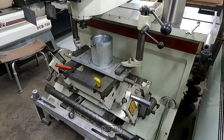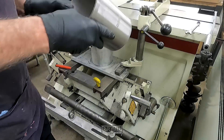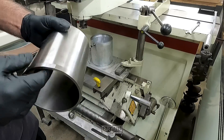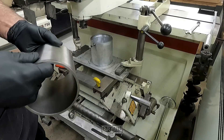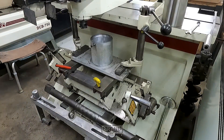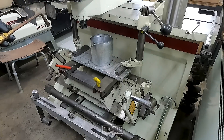It can be changed at the racetrack without having to do all that stuff there. Some of the sleeves come that way depending on what block it is. These sleeves are rough bored — there's no o-ring in them — so I'll show you how to put it in, get it bored, and get an o-ring cut in it.